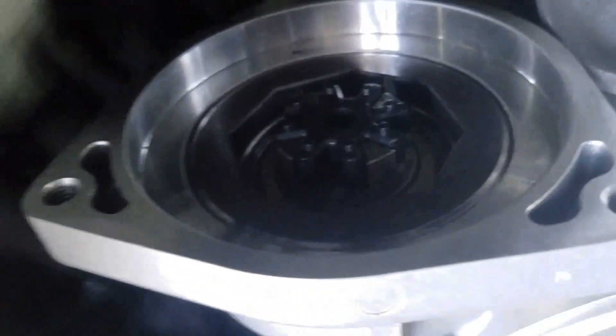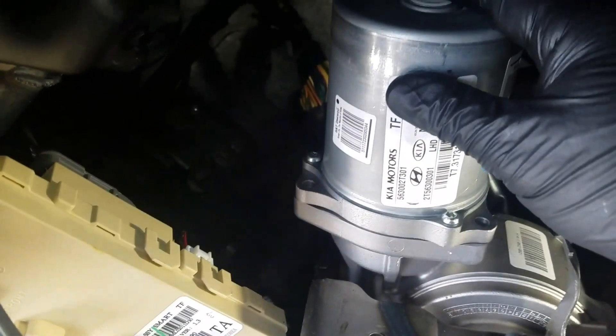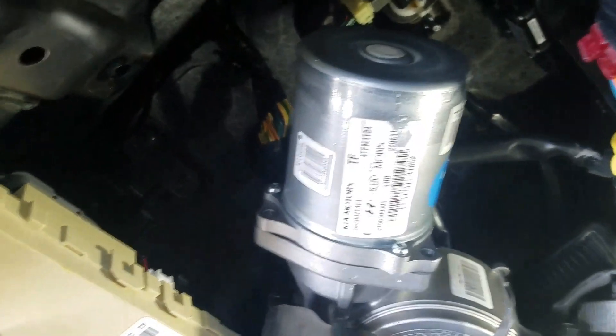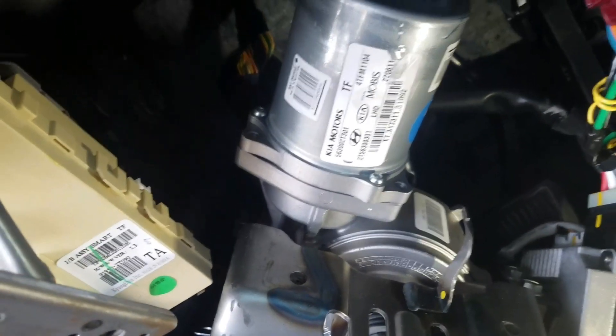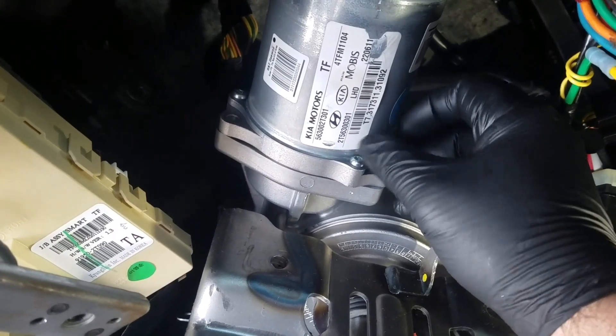If you moved the motor, you're going to have to try to move it to line it back up. You just want to push on it until it's fully seated — it's important to make sure it's fully seated. Then grab the motor and put it back on. If you didn't move the motor itself, it should line back up no problem. Give it a little shake to make sure this line right here is lined up. If it's not even, don't force it down with the screws because you're just going to mess the new coupler up. After you make sure it's fully seated, take these T30s and put all three of them back in.